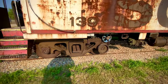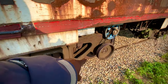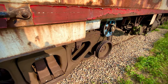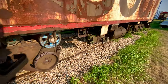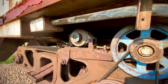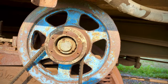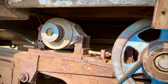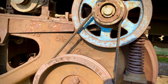Check this out — look at the truck. There's an adapter there to power this axle. I've never seen anything like this — absolutely nuts. That's to provide power inside. Look at that — that's a generator right there. Then you have a first reduction, then a second, and then it goes over and provides power to the caboose.